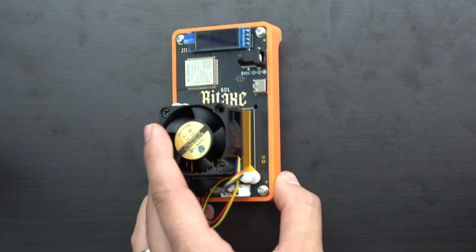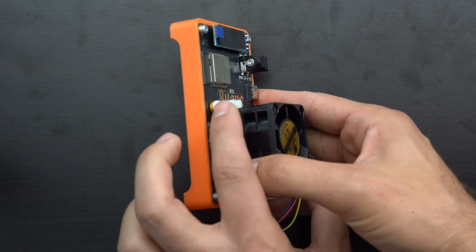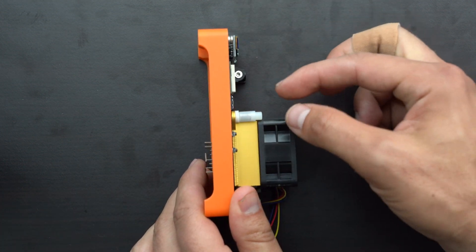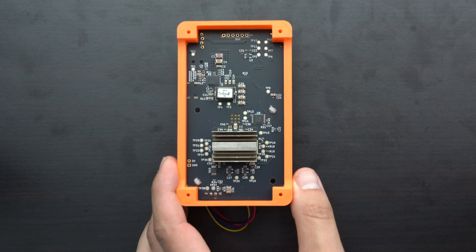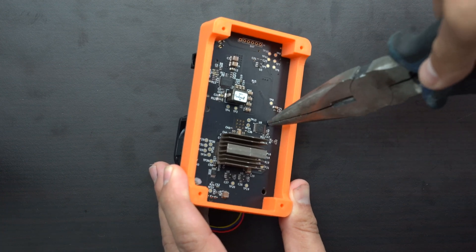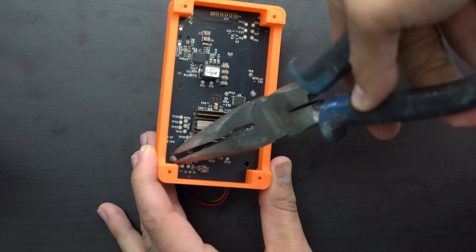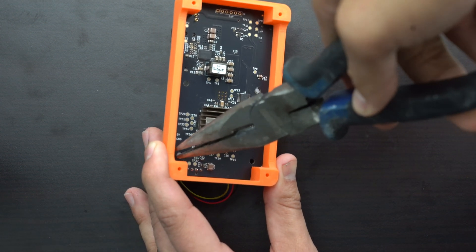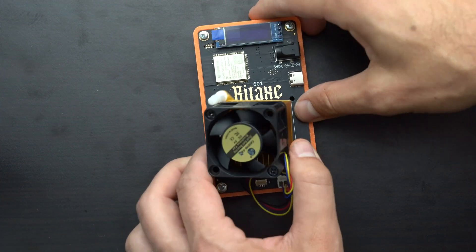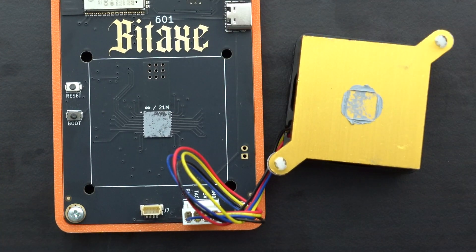Let's go ahead and dive in and start swapping out the thermal paste on my Gamma, and we'll see whether or not that actually helps to solve my overheating issues. To start things off, let's look at how the heatsink is connected. There are two connectors here on this specific BitAxe — these are removable pin connectors. Basically just squeeze those, and there are springs in there that'll allow those connectors to pop out. Some BitAxes have screws; there's a variety of different mounting methods, but these ones just have those little pins. So we give them a little squeeze and they pop right out. And there is two. Now we've got the heatsink off and the chip exposed.